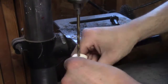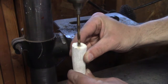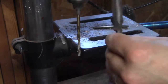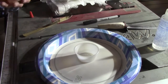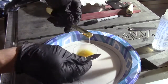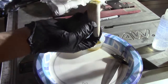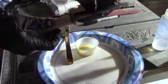I started with a small drill bit and now I've gone up to a bigger size. This drill bit was the same size as the tang. Normally when I do the epoxy for a full tang knife, I put all the pins in and have a whole bunch of clamps. This one's a little bit different — I'm going to assemble the handle and use a different clamp, since there won't be any pins in this knife.